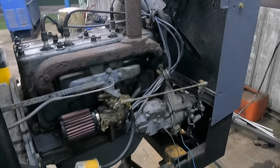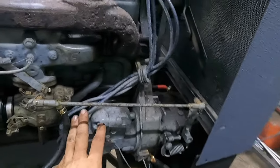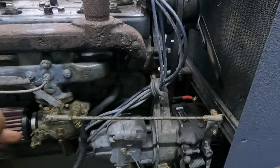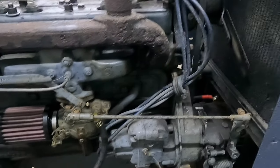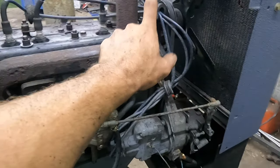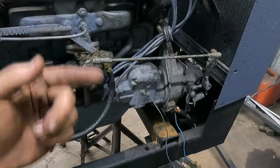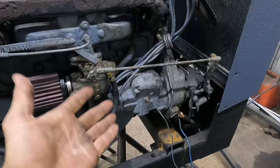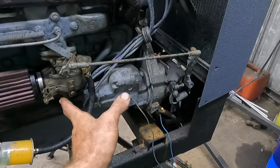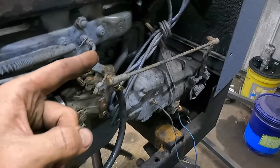So it's been a minute. I've been messing with the wiring of this. I've had to go back and look at some old videos. Couldn't get it to go. Finally searched enough on the old interweb, figured out the firing order is 1-3-4-2, but I couldn't remember which one you start on. So it changes. I'm pretty sure you can set it differently, but in this case, number one is, if you're looking at it, top left.